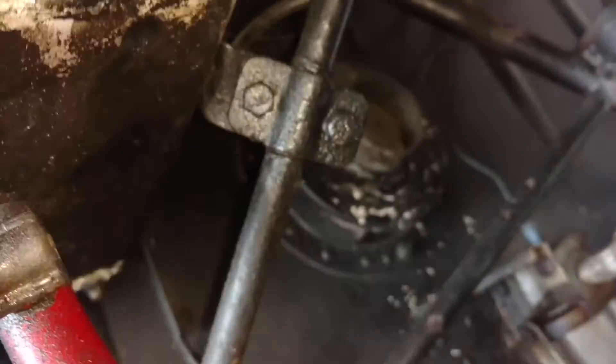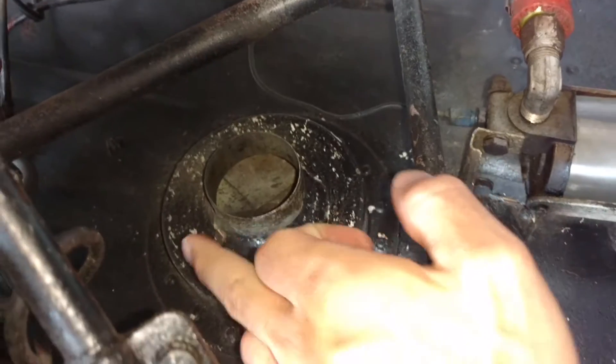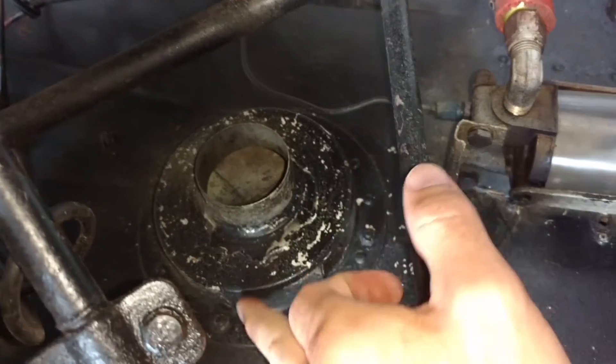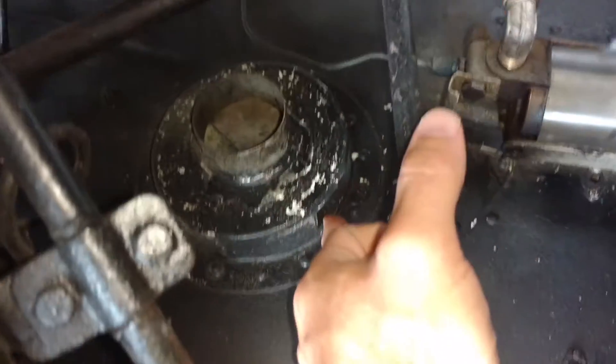This little two-inch opening here, that's where some more scat tube would normally connect to, and that's going to be for your cabin heat. So that's where you're going to get your cabin heat from — it's going to come off the other exhaust manifold on the other side. Obviously we have two exhaust manifolds: one for the two cylinders on the left and one for the two cylinders on the right.